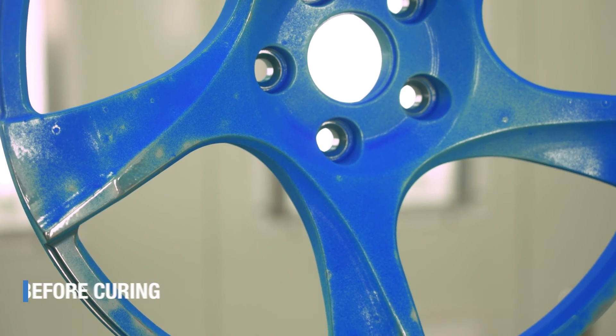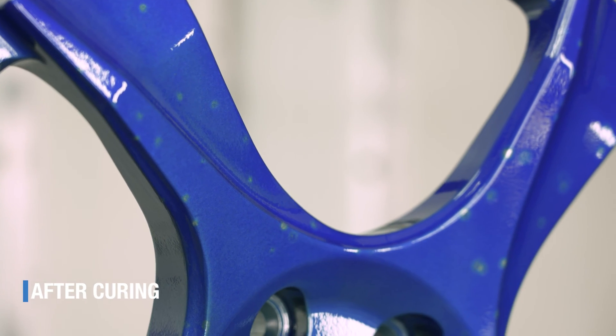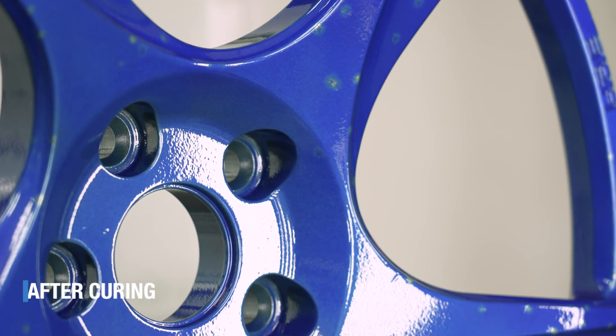Back ionization is also referred to as starring, and it's going to become visible while you're coating and remain visible after curing. Here is what it looks like before curing, and here is what it looks like after curing. As you can see, those stars are right where we left them — this is not a problem you can ignore and hope it goes away.